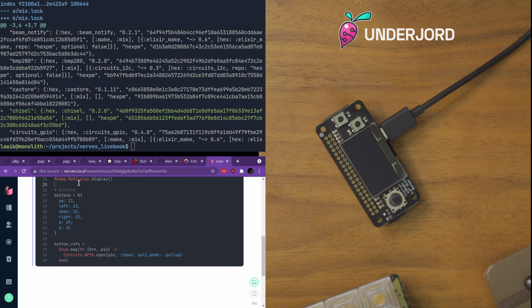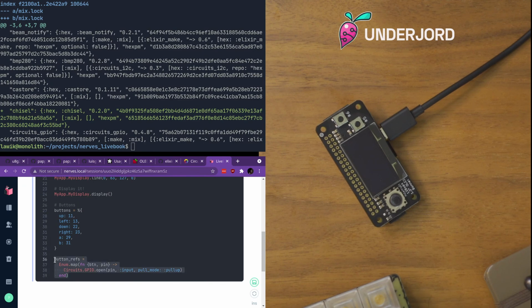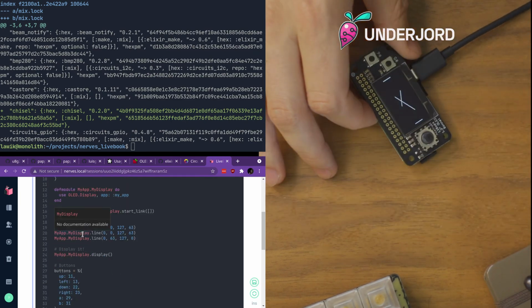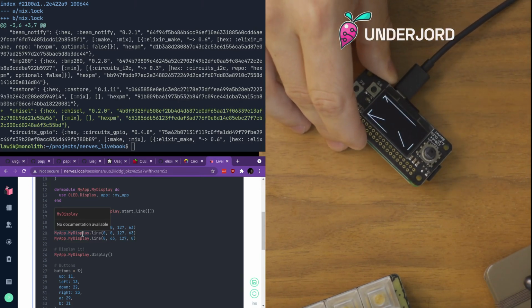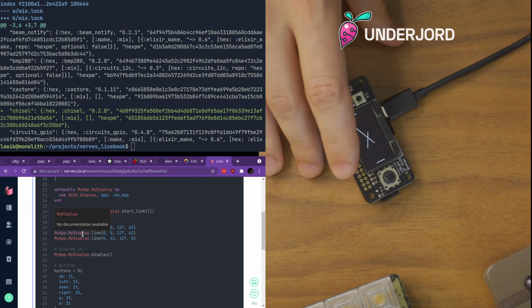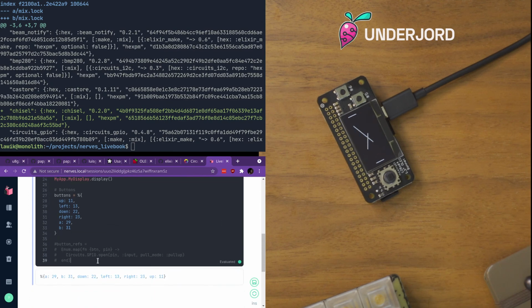And then I started looking at reading the button states, but I haven't actually done anything with that yet. So let's comment those out for now, because I haven't tried this. I was mid doing that when I actually should start the stream. But we run this, and now the screen is on and showing sort of an X. Ooh, I think the recording is getting that trippy flickering of the update frequency. For me, it's completely still. But yeah. So the buttons are using GPIO, general purpose input output, and that's a very common way to talk to very simple electronics.